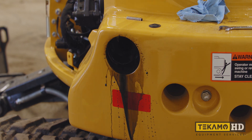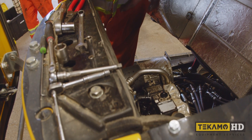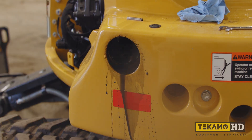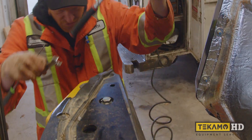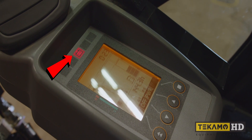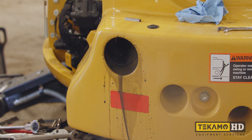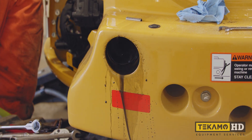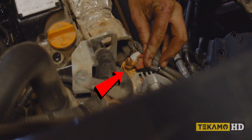You want to let it warm up a little bit. Make sure you don't hear any funny noises. Everything sounds good - we don't have any fuel leaks. You can start to see the steam coming out of the exhaust now - that's all the water burning off in the muffler. I pulled my tools off so they don't vibrate off now that the machine's running. Make sure there's no warnings on the dashboard, no buzzers going off. We do have a battery light on so we're probably not charging. The alternator was under water so I'm not surprised - the connections don't look the greatest, all rusty. The inside of the alternator probably looks the same, so we're probably looking at replacing an alternator.